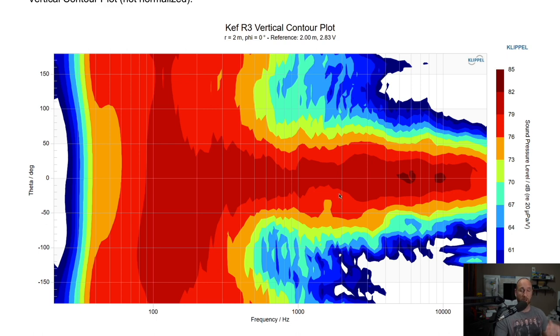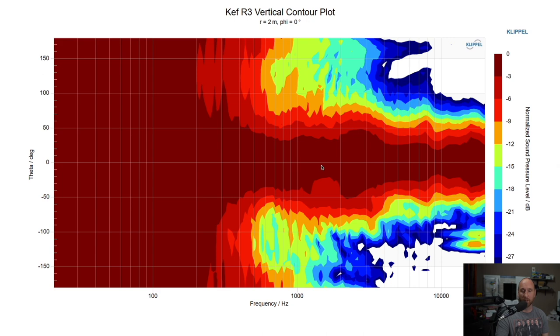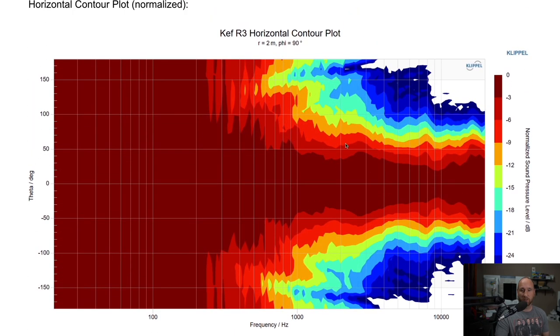The vertical contour plot should be very similar to the horizontal, except you have to account for the mid-bass which is below the speaker. There may be some discontinuity there but it's not severe. I do wonder about one area — possibly some high lobing — but it could be a diffraction effect from the cabinet. I'm not going to pretend I know what it is; I just find it interesting. Overall the normalized vertical contour looks quite good. This data also tells us the radiation pattern isn't really wide — some speakers like the Revel F226Be go to ±70° horizontally; these are closer to ±30–50° depending on frequency.